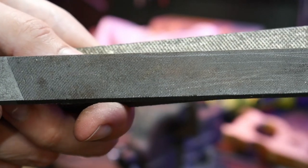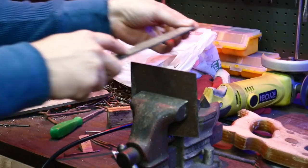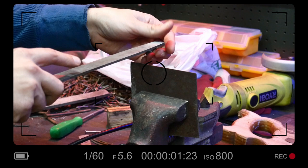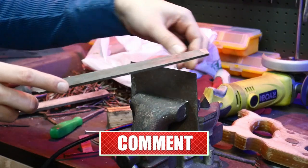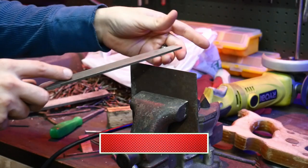The wood file is a coarse file while the metal file is much finer. When you're filing, make sure you push — don't pull — because if you pull back on your file it's gonna flatten those little ridges. The moral of this story is this is the one time it's okay to be pushy, so just push one way. That's gonna create a flat surface and also push a little more metal to create a burr to help scrape the wood.